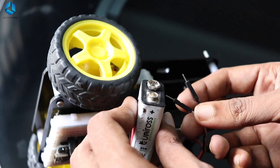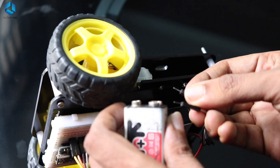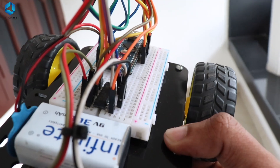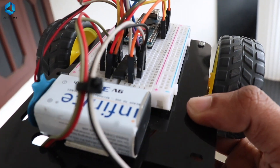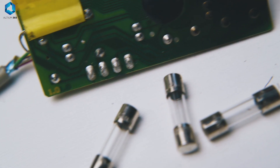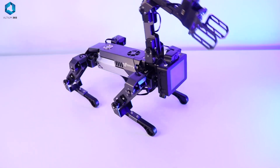When connecting your battery to your robot, there are a few golden rules. First, polarity — the red wire is positive and the black wire is negative; if you connect them wrongly, you could damage the robot instantly. Always use a proper battery holder or connector, not just taped wires — it's not safe and doesn't last. If your robot draws a huge amount of power, use a fuse so that if something goes wrong it can protect your robot. And always add a simple on-off switch — it helps a lot in controlling active robots.